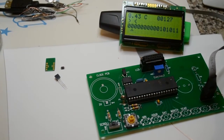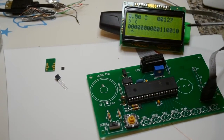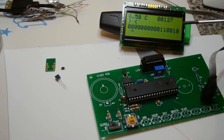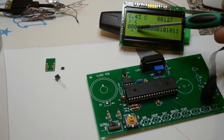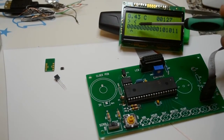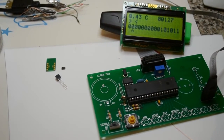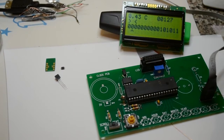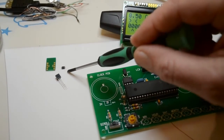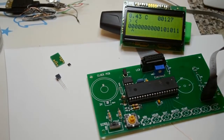The math doesn't work when the sensor goes negative — it just stops. There are 16 bits of data coming out of the sensor. If it was reading zero, there would be a string of 16 zeros. I've highlighted the 15th bit here, which I'll demonstrate later. This is just a configuration code to confirm it's all working. The sensor itself is a surface-mount device, six-pin, but only three are used.